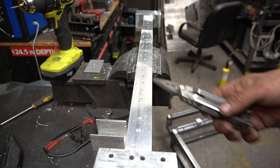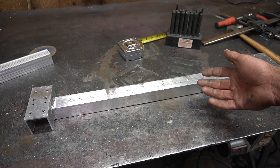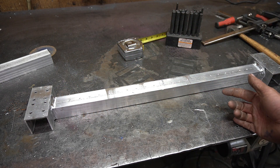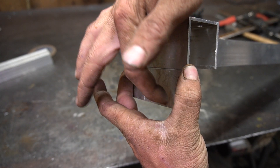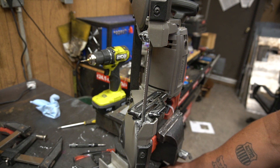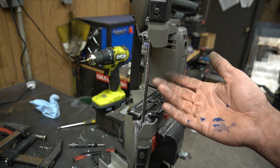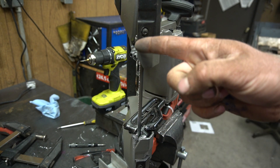One hole missing out of 22 — that's like a five percent failure rate, I'm cool with that. We need a mounting point for the cable chain that's going to carry the wires for the X-axis and the air tube. I'm going to weld a little drop on here and have a couple mounting holes for a piece that will go underneath the frame. I've zip-tied the trigger on the bandsaw — the utility of the bandsaw I built did not justify the size of it in a small workshop, so every square inch counts.